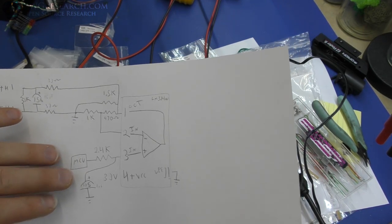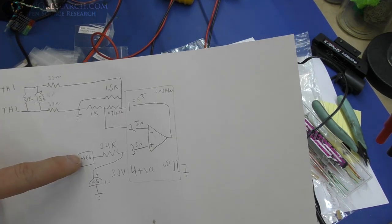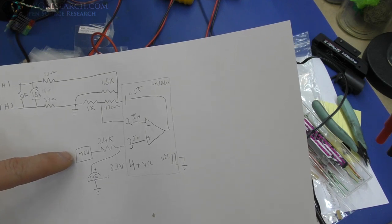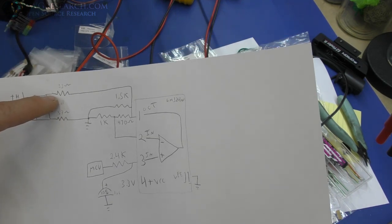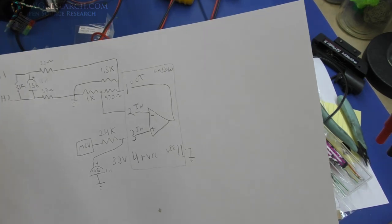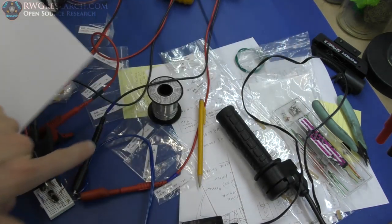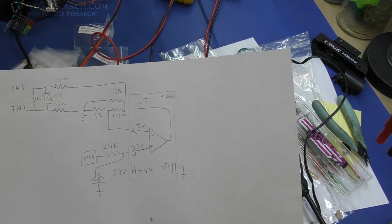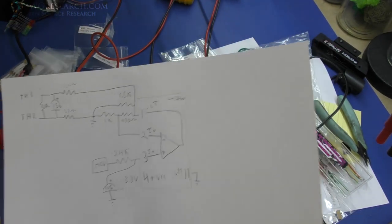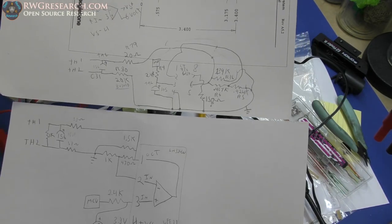The interesting thing is, if I adjust these values, I could probably get the same result, where at about 2.1 volts, I get my maximum 3-volt output when driving this at 5 volt. Now, I found that interesting, because if I adjust these values probably more closely to what they have, because I don't have the exact same numbers, because I didn't have the same resistors, and this may actually be measured a little off, so forth and so on.